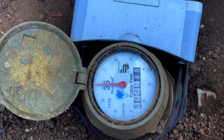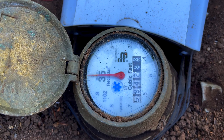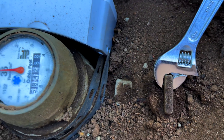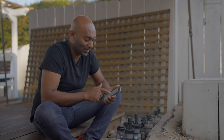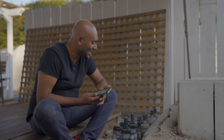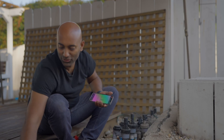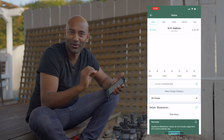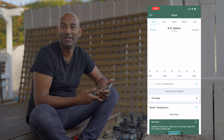There's no more sunlight but we thought we'd get it done today. Before we conclude, I wanted to do a calibration test. I went to my main water meter and shut it off, and as soon as I did, the water usage for two minutes dropped to completely zero — which means this thing is pretty accurate. More good news: we figured out all three sources of the leak. 0.04 gallons per minute was leaking from our guest bathroom, 0.15 gallons per minute from two sprinkler heads near the fence, and culprit number three — a little shutoff valve I turned off. For the past 10 minutes, we are consuming zero water.